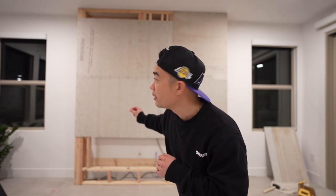I just started putting up the cement board. We covered the majority of the walls so far. I used some specific screws for them, about six to eight inches apart, so they're pretty stable. Now I want to fit the fireplace into the insert and see how it looks, turn it on, and make sure it's working properly. After that, we'll finish the rest of the cement boards.